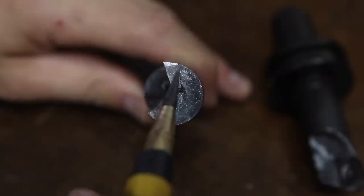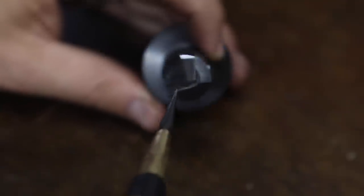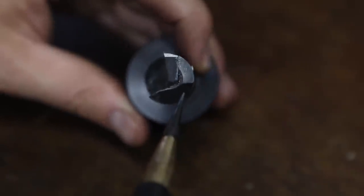The problem with the one-inch tool is it doesn't have a TTS-ready adapter, so you'd have to reset your Z each time. Tormach hooked up with AB — I think because of our video, which is kind of cool. Sometimes you forget the impact these videos make. So this is their three-quarter inch version. I have no problem with three-quarter over one inch, though I will say there isn't quite as much relief on the backside as on the one inch, and we've been creating some rubbing on it. Still, it's an absolute great tool — it has repeatability, it's ATC and TTS compatible, so it's a real win.